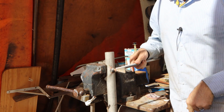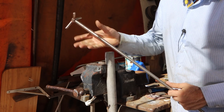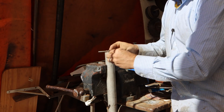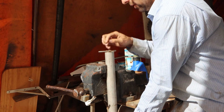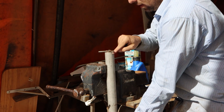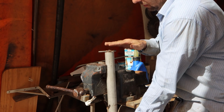Now in order to get that to go into there, we will take the little 3-piece thing that we welded to a nut onto a piece of this threaded rod. I'm going to use the full length of that threaded rod. I'll slide that down there, and then I can roughly get the bottom centre, roughly get the top centre, and then I know that the nut is perpendicular. If we just mark off that, I'm going to grind down, this is 8mm rod, I'm going to grind down 8mm and sit it in flush.